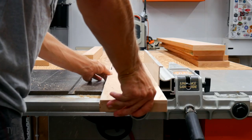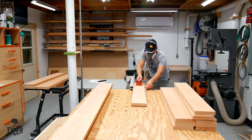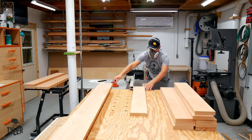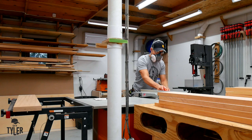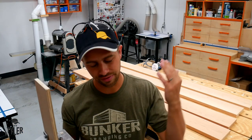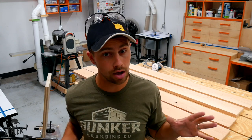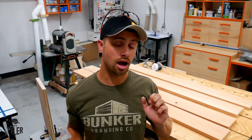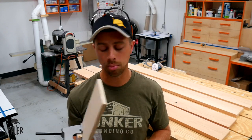As you can see there are a lot of different pieces and you're continually cutting off one side. I was careful to reference those numbers and mark them again on the side I had just cut off so I always had a number on both sides. Now that we're finally done milling, I've got all of the faces that will be facing out when the bed is done facing up on the workbench. I want all the faces oriented the same direction so that I am referencing the fence the same for every single board.